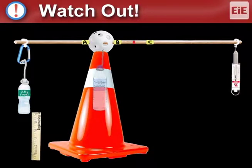The lever arm is used to raise the load 6 inches, but the dowel should never travel beyond a horizontal position. Typically, this means that the string between the carabiner and the load should be about 4 inches in length. We will show you how to adjust the length of string on the load so that the load is raised 6 inches when the dowel is horizontal.